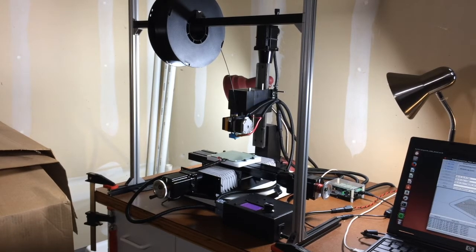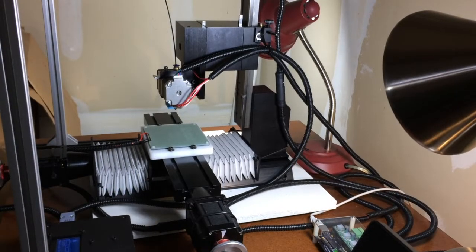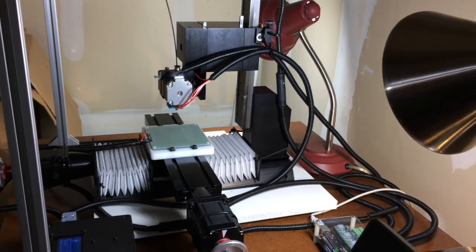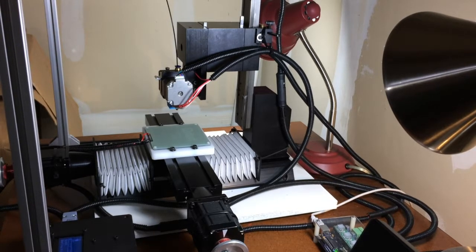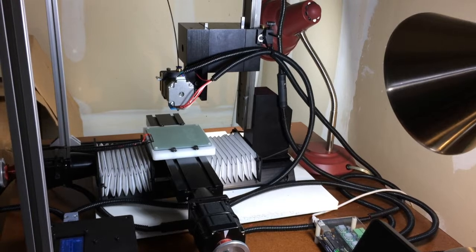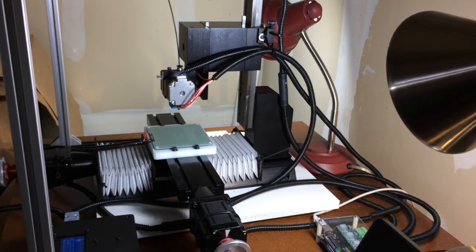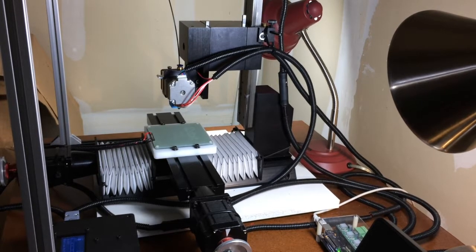Hi, this is a Sherline 3D printer demo. I have a Sherline 2000 mill that I converted to a Sherline 3D printer. Actually, I have made two conversions here. One, the Sherline 2000 mill was converted to a Sherline 5400 column and 14-inch base. Two, I replaced the Sherline spindle with the Sherline 3D printhead bracket and Sherline 3D printhead saddle mounting plate.